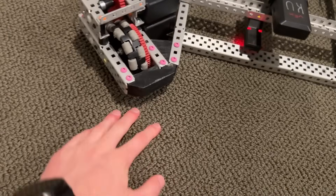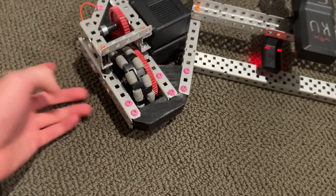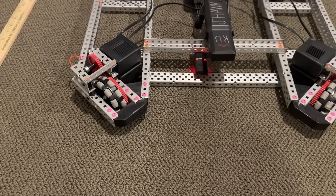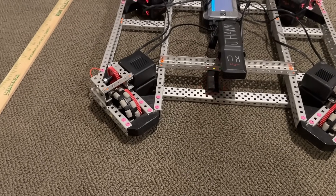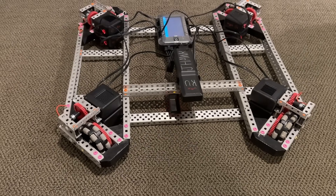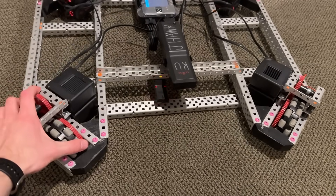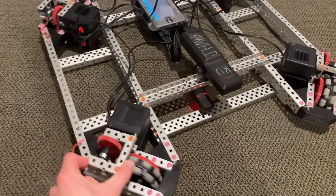Right now there is going to be a little bit more friction here just because I'm on carpet. You do still have the friction of the Omni rollers going sideways — that's always going to be a factor. It's less prevalent and pretty much negligible on the VEX fields, but this carpet does have a bit higher friction than the VEX fields do. So now that I've kind of proven that X-Drives are faster: this is running 86 inches per second with 360 RPM on 3.25-inch wheels.